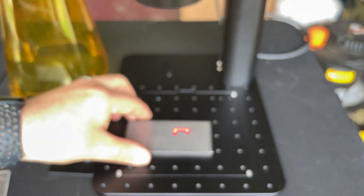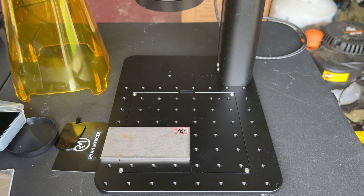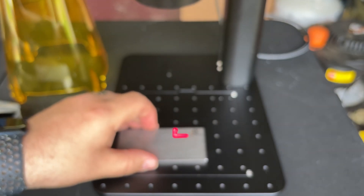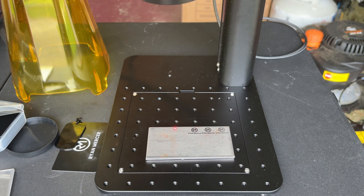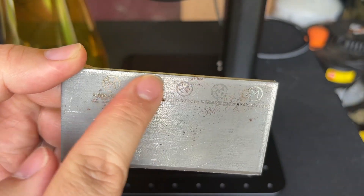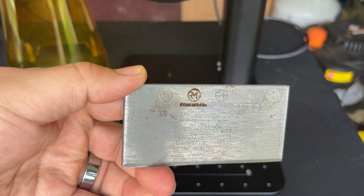Let's try this again and I want to use as much of this piece as I can. I apologize — I thought I was in focus that whole time. That actually came out really nice though; it's not really a deep engrave. We're going to go right next to it and this time do a lot more passes. I forgot to focus when I changed the material. This is an experiment — I've taken that initial deep engrave and slowed it way down to 200. I did get some deep engrave there, but also a lot of overburn. The slowest pass is the deepest, and now that it's in focus it's a bit deeper. I'd come back in with a coloring pass after.